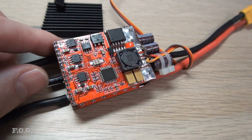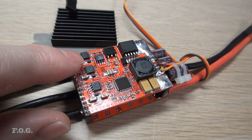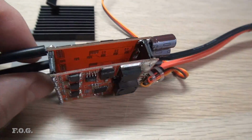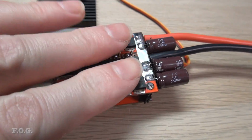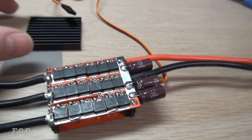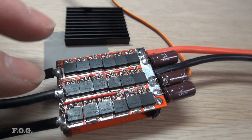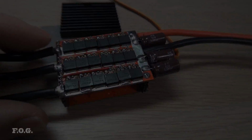And this is also the board that I used in that testing analysis with the replaced IR2101. So this board I know is good as far as the processor board goes, and this is a little bit different, and again only using a single board instead of triple board, so hopefully that means less to go wrong. So all I need to do is get the heatsink on there, and I'll put it back in a bit of shrink wrap, and away we'll go.